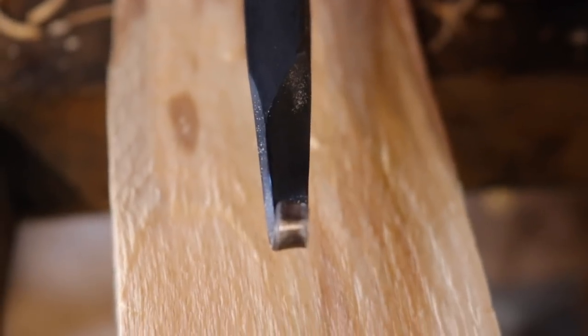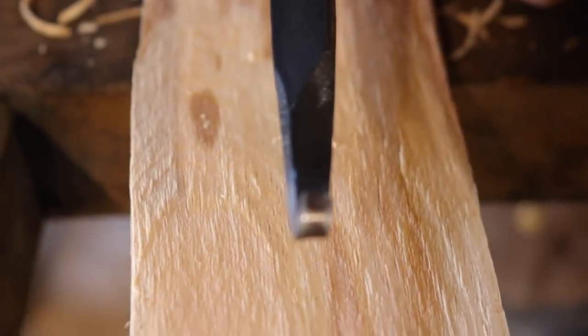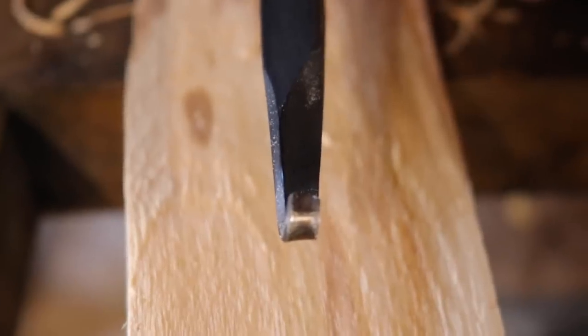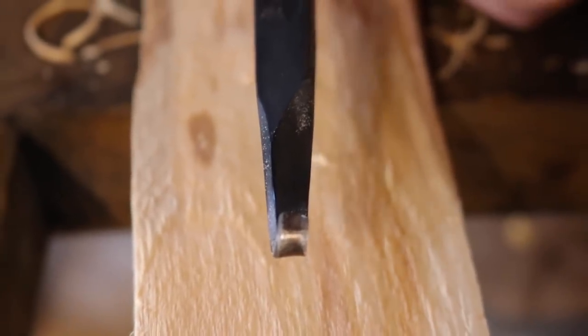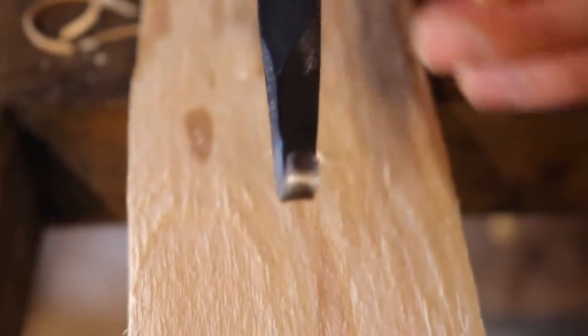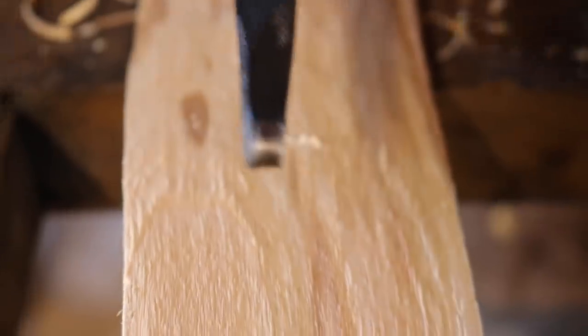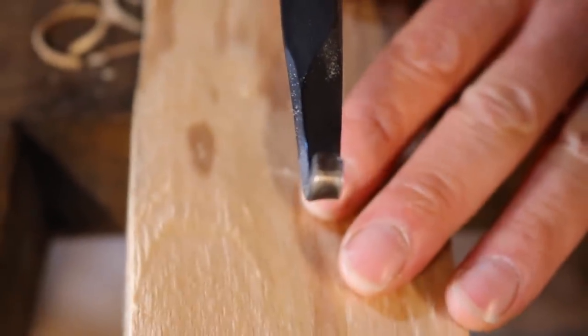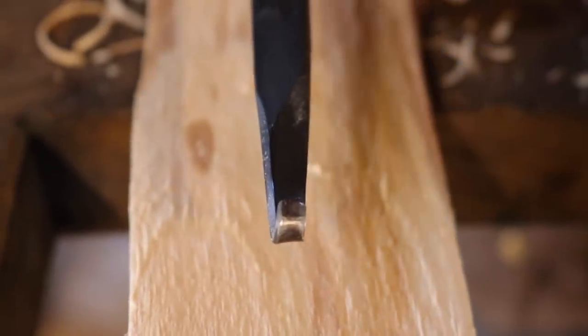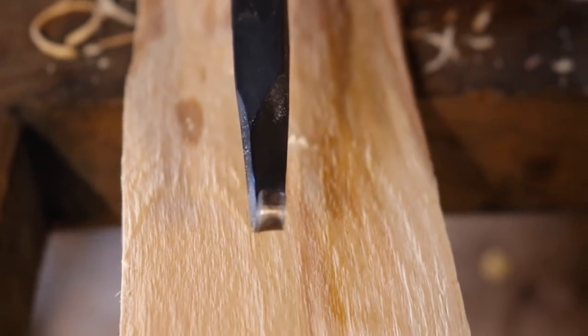So this is the tip-up tool, and I'm going to try to explain for the camera the angle that I was using when I was shaping the back of the bowl then. And this piece of wood below the tool is only so that you can see the tool clearly, hopefully. So I'm not saying this is the surface of the bowl. But the tool here with the tip up at the sky is what I would call a horizontal position.